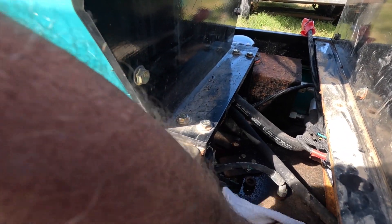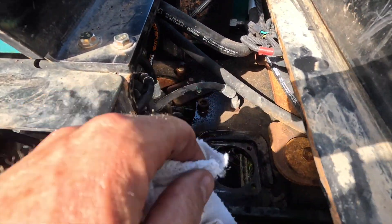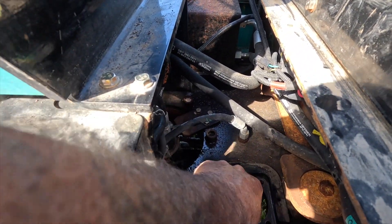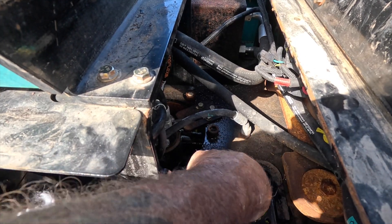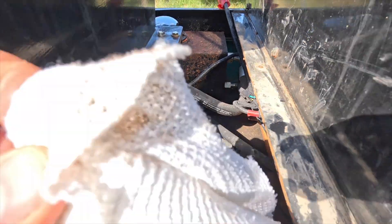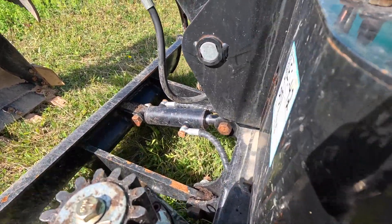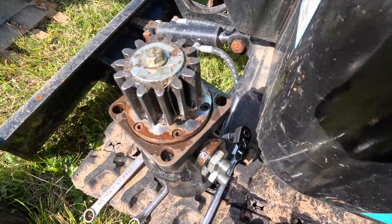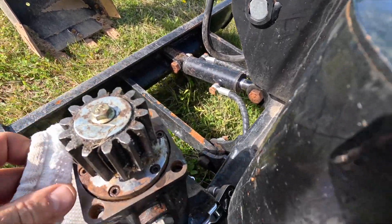What I discovered is this thing has a heavy layer of paint — they didn't clean the paint when they put it together. That's a no-no. When you have mating surfaces with a lot of strain, the paint has to be cleaned off both sides before you mate them together. That's probably what caused this. The other side also has paint, just a lighter spray coat, but metal-to-metal contact is required — no room for movement.